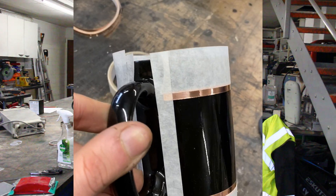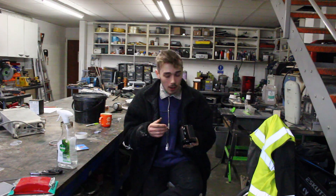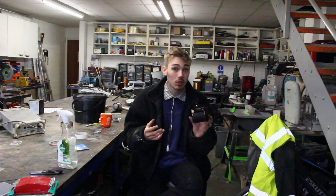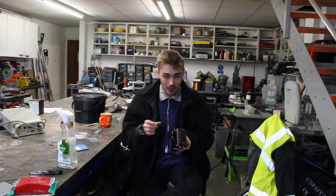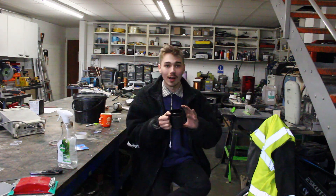This is what the cup looks like with the copper on it, and this is what it looks like when it's painted — it's looking really nice. Before painting I had to think about a few things. First, the contacts need sufficient space between them so they don't short or get accidentally reversed. Another consideration was the space at the top: initially the copper strip was quite high, but I realized you'd get copper in your mouth while sipping, so I brought it down enough to get your lips around it comfortably.